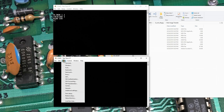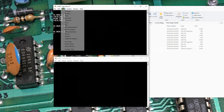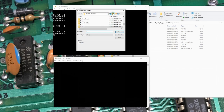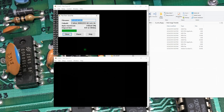Apparently I've got the baud rate too high — 38,400 baud. You just can't send that file up at that speed; it's too fast for the 8080 to react to. So let me reset and restart the monitor — stop, reset, examine, reset the monitor. This other terminal session is set up at 19.2 baud. We'll send the monitor up on this terminal instead. Let's do a hex load from TTY0, File > Send File. We need to find the FDC+ folder — it's under 8-inch floppies, disk image transfer — and grab PC-to-flop.hex. We can see it's uploading correctly, and scrolling back we can see the first address loaded on the machine was hex 0100. The PC-to-flop code starts there.